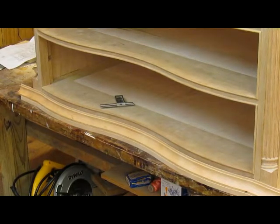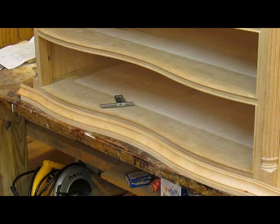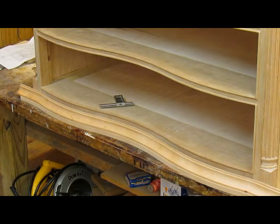There it is with the half-inch piece of molding underneath, sticking out. The molding sticks out an inch, and the 7/8ths-inch molding sits on top of it and does the transition from the flat to the edge. It's an eighth of an inch set back, and then the bracket feet go underneath that piece. Beginning to put it together here — obviously the corners have to be mitered — and that's pretty much how it's going to look. So the next step is to miter the corners.